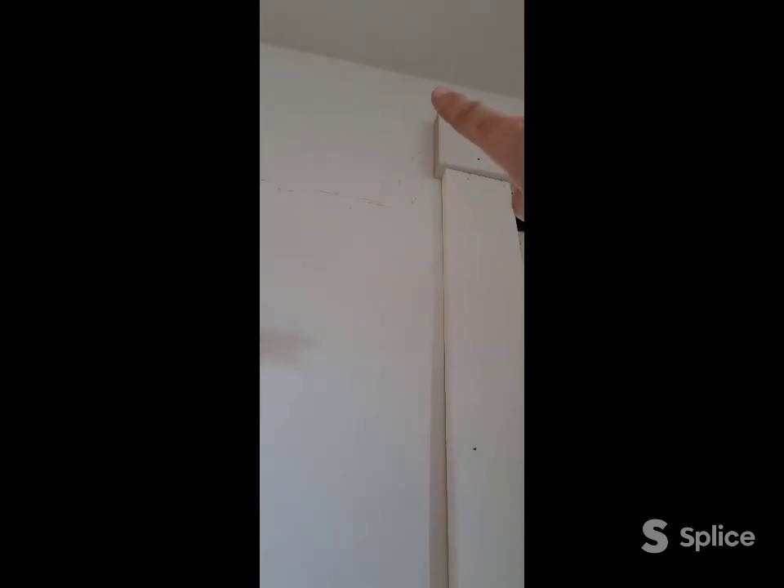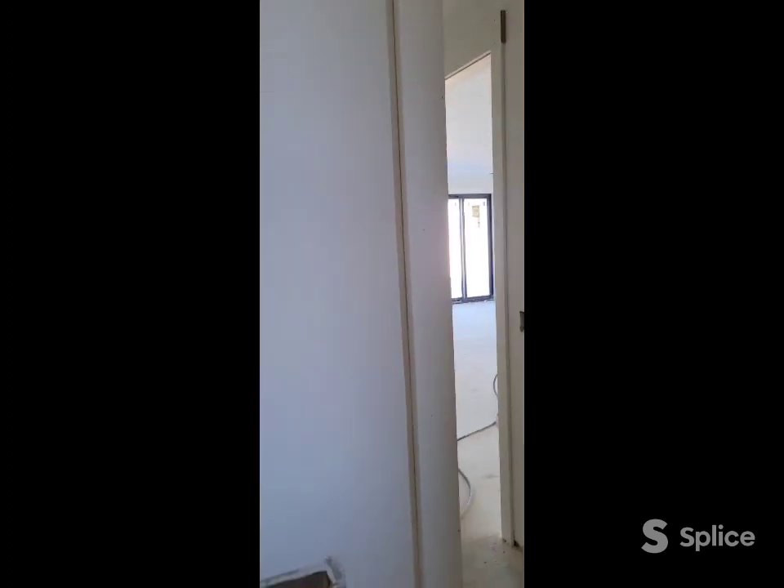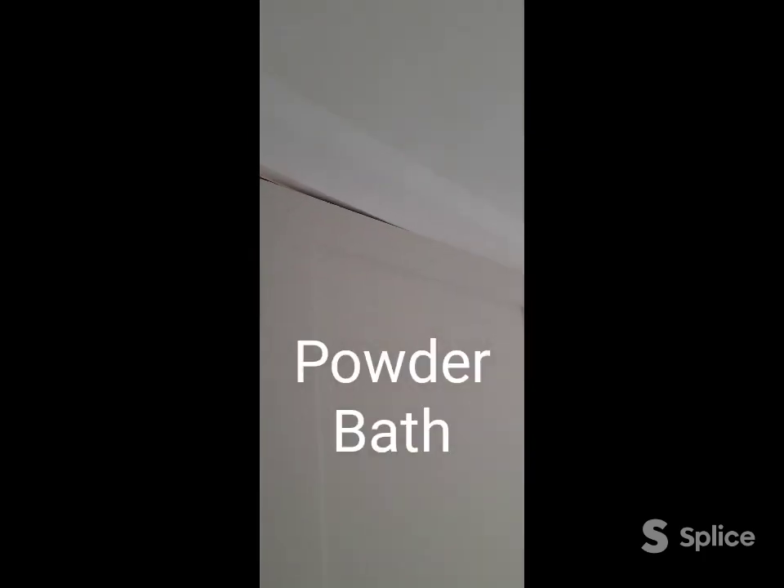I break the edge — if you look at it, it's got kind of a round-over already, so I just kind of match it on the edge there. I'll run my sandpaper on the corner and just round that over a little bit more. It makes it nice when it's all painted. I've had some painters tell me they like that it gets rounded over because the paint sticks a little bit better than just a sharp corner, like what you'd get off a chop saw.